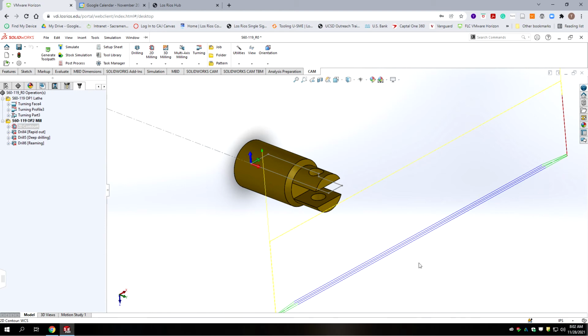Okay, we have our toolpath coming through here. We should have one rough cut, one finish cut, and they're 8 thousandths apart. That should cut the slot right to its nominal size. We can make adjustments from there based on conditions. Okay, so now what do we have?